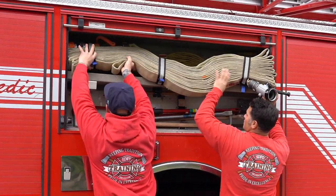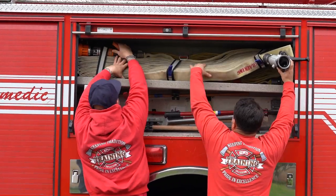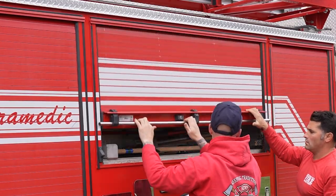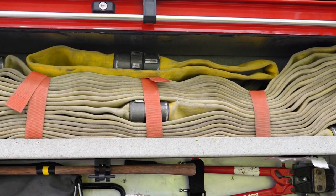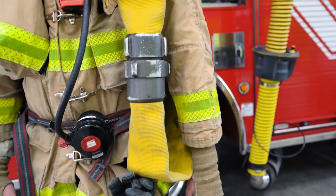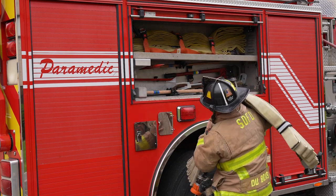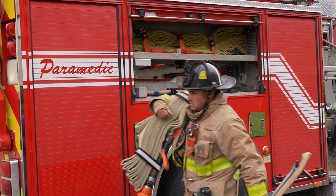The six-foot whip can simply be connected to itself and stored loose with the hose packs. If you're planning on utilizing the building's standpipe, simply drape the whip over your shoulder for transport — this will keep your hands free for other equipment. Firefighter Dubois is going to deploy the pack now — he's going to roll it right down onto his shoulder. Notice that the gated Y isn't hitting him in the head; it's to the rear, nozzle forward.